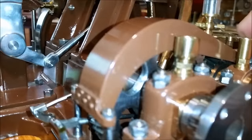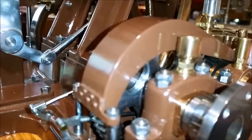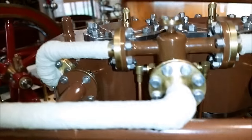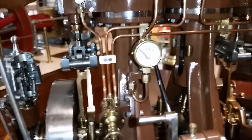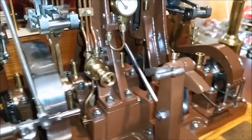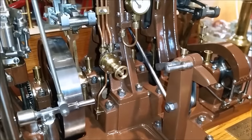They built beautiful little oilers — this is a mechanical oiler and I'll demonstrate that when it's running in a moment. Up here you can see the oil line coming up to feed the cylinders steam cylinder oil, and there's a little pressure gauge right there, plus a few more little details.